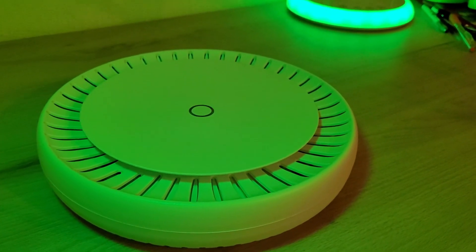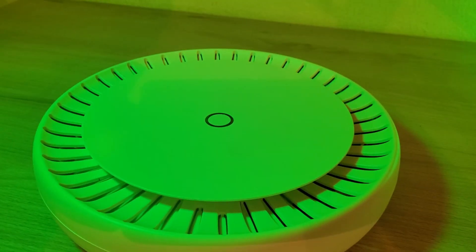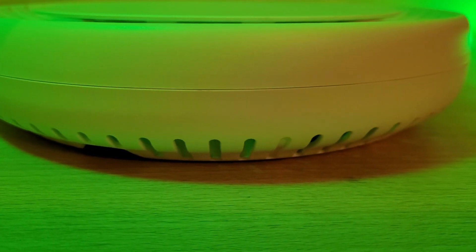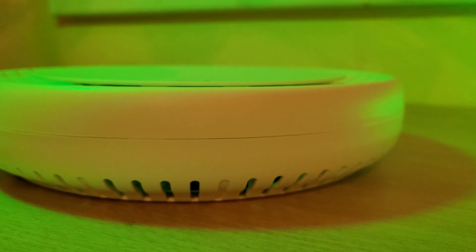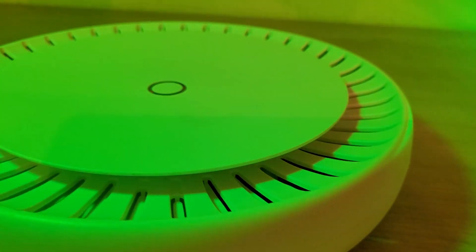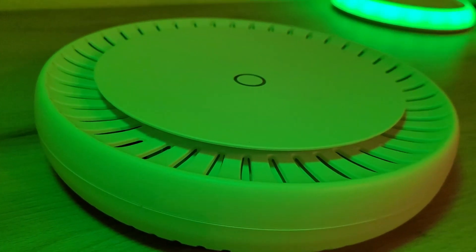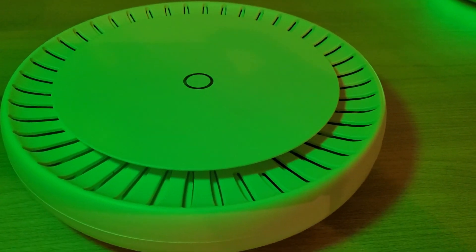Other than the Wi-Fi Wave 2 hassle, I've never experienced problems with the CapAX and it's been solid. Overall, this access point is great for businesses and larger homes which need good coverage of a large area. It is a modern-looking but a bit larger device with a diameter of 22.5 cm and a weight of 602 g. It has a lot of great features, such as PoE Out for powering another PoE device without using another switch port.